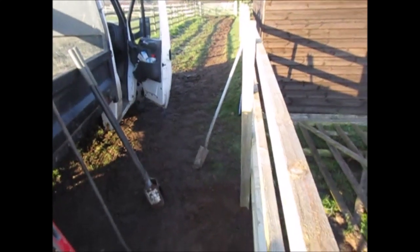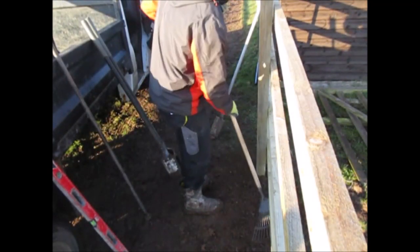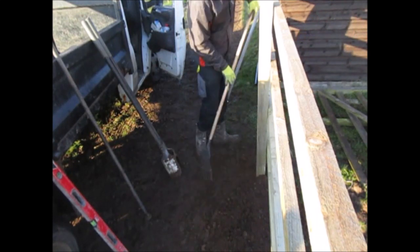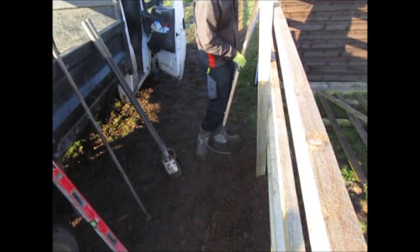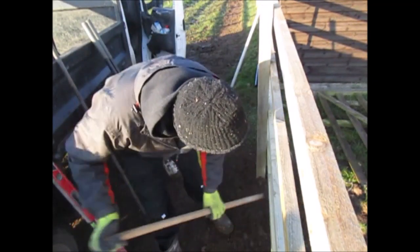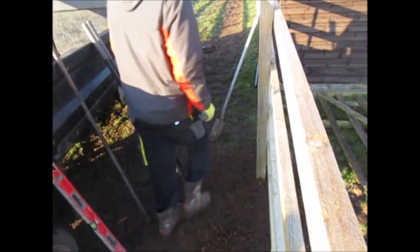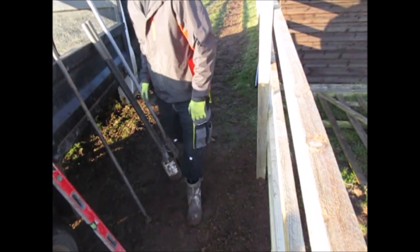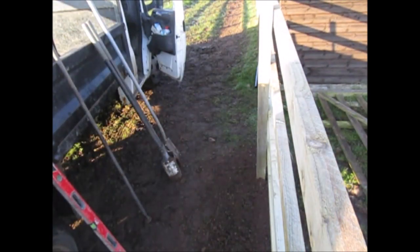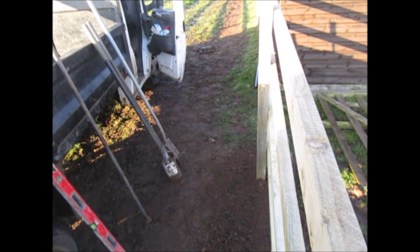This is where the rake comes in — you've got excess soil around here. It's not necessarily about getting rid of it, just breaking it up and moving it around so it looks a bit neater. That's how I've reset the post — I still need to nail the rails up, but for the purposes of this video we've shown you how to set a post. This is a post-and-rail job, but I will be doing one on standard fencing. I'll link that to the back of part one. See you later.